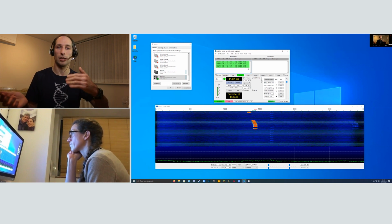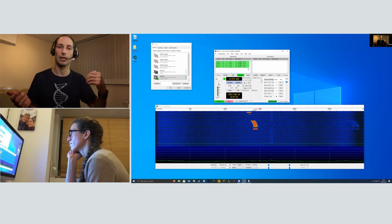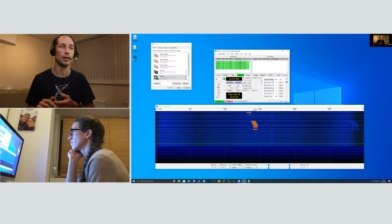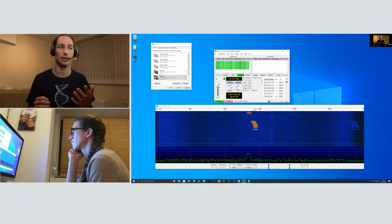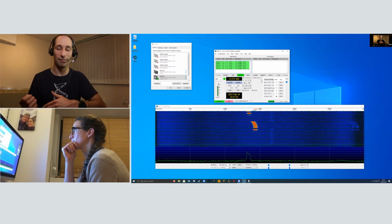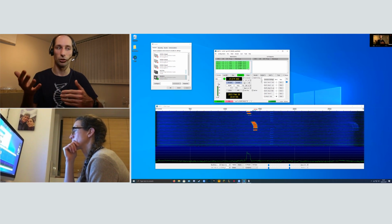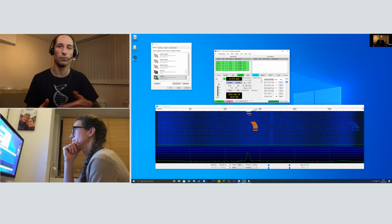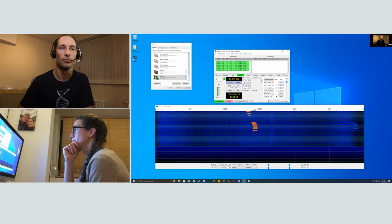After that, you'd expect to receive a report from me. This wouldn't be a 5 and 9 like you would use in voice, but instead it's a signal to noise ratio, so something like +10 or -5. After that, you'd send me my report, I'd acknowledge it, and then we'd say 73 to each other both ways. So that's the sort of flow that these QSOs take.